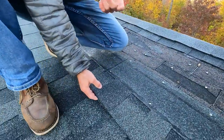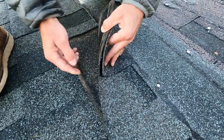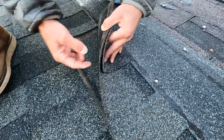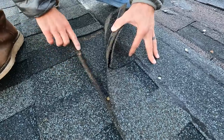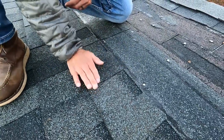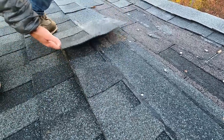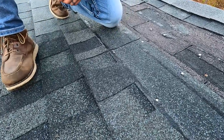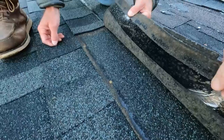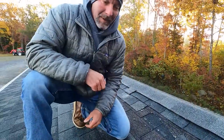The first thing Luke told me about was that the shingles weren't sealed down. This is the adhesive that holds the shingle together. Most of the adhesive today is put on the back of the shingle, but you can see here it's actually on the top of this shingle — the weight of the shingle is what holds it down, and the sun eventually heats it so it can no longer come up. There's nothing holding these shingles down; the nails are the only thing holding them on. This adhesive is everything. The shingles we're putting on today are 130-mile-an-hour wind resistant. I'd be surprised if these old ones are 60-mile-an-hour wind resistant.